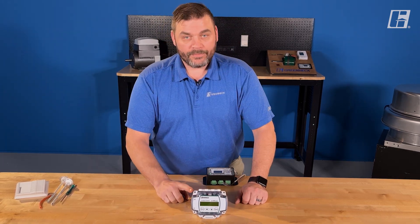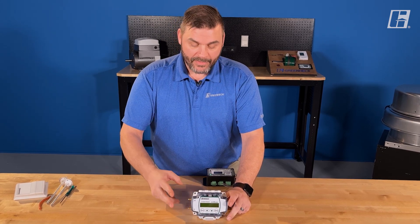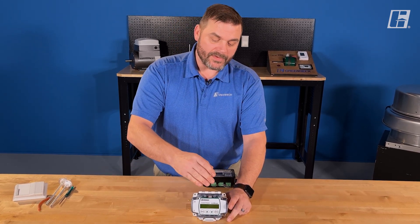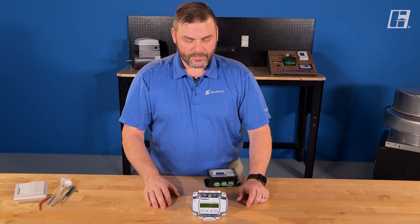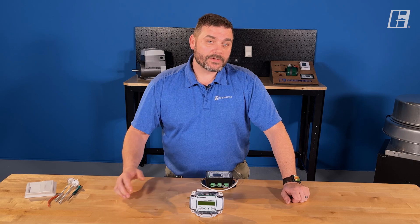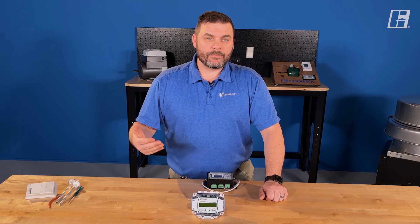What this will do for you is monitor two points of pressure and then control the speed of a fan to maintain that relationship. The constant pressure controller simply will control the speed of a fan to maintain a pressure or CFM point.